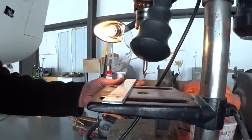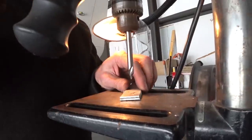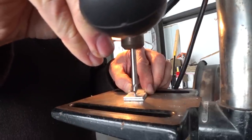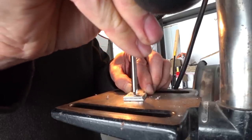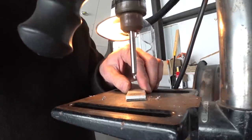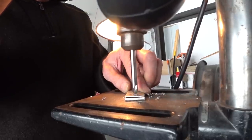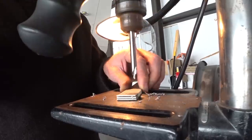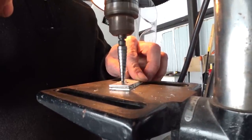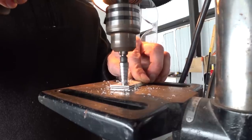Back in the shop now — these are some strips of aluminum that I cut at Brit's place. These are going to make the little safety guards around the pulley, so if the cable comes loose it doesn't slip out of place. I need to drill a half inch hole in either end. I've got all four of them just taped together so I can drill them all at once. I just run in the centering bit — I'd already hole-punched where I wanted the hole to be, basically center of the strip and a half inch in from the end. Then I use the step drill to take that up to half inch so it can slide over the main half inch rod. Some people don't like step drills, but they save a lot of time and if they're sharp they do an amazing job.